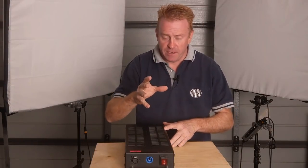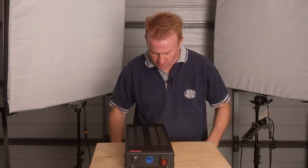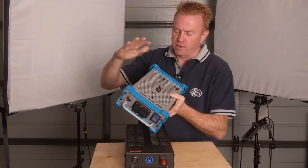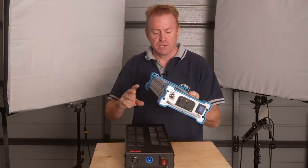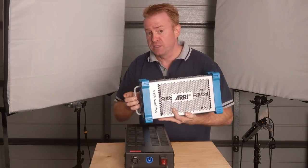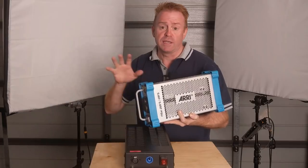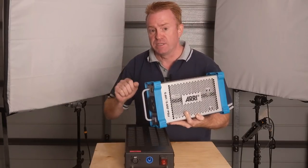A quick pickup: if you're a gaffer and thinking you'll just use your ARRI SkyPanel PSUs to run this, you could — but you'd have to crack open the PSU and trim the voltage down, because the SkyPanel PSU factory setting is not 48 volts out, it's 49.95 volts. At that voltage you won't damage the controller, but it will come up with an exclamation mark telling you the power is too high.